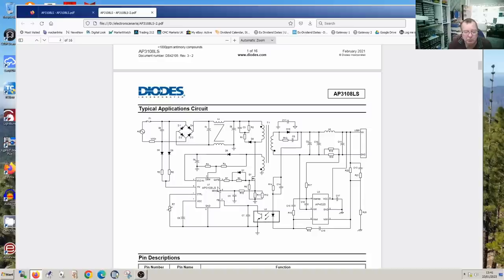But once it's running, this chip starts to drain the capacitor, and it pulls power out of the capacitor faster than this resistor can put power into the capacitor. So the voltage here drops. And normally they're designed so that if it drops down to, for example, 12 volts or 9 volts, it then switches off. If everything goes okay and this fires up, this diode via VCC in provides enough power to keep this capacitor charged, and it keeps running.